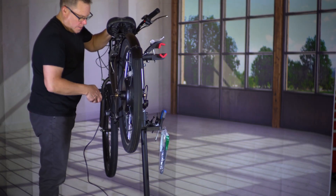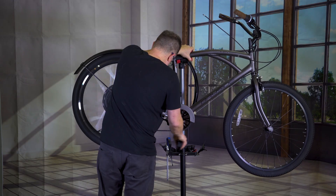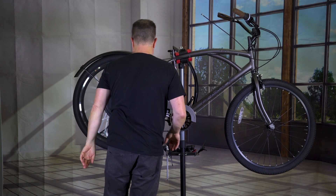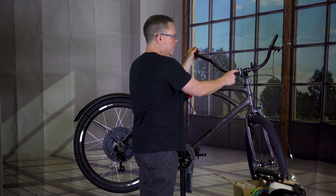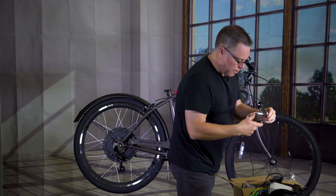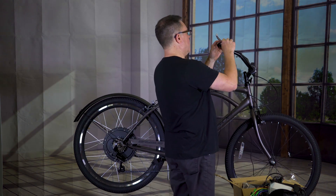This is the washer that I just made right back in here. What was happening is this part of the frame was binding up with this part that needs to be able to spin freely right here on this cassette. So I added another washer — I actually added two just to give it a little bit more room and then stretched these out just a little bit more. When I'm turning this, that works way better. So I put the gear shifter, I just slid it all the way down to here.